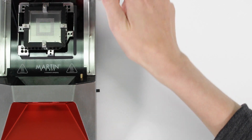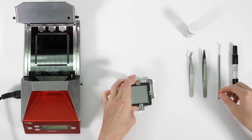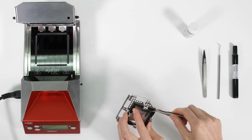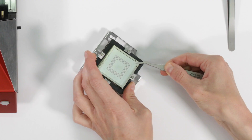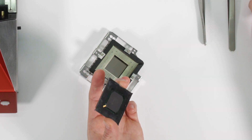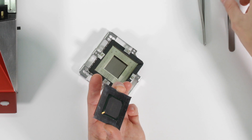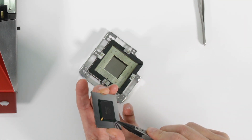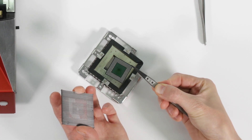After additional cooling time, the fixture can be taken out of the mini oven. Flux residues can lead to components adhering to masks. Carefully remove the component from the mask. It helps to remove it while still warm and to work with flux cleaner if necessary to ease the separation. The SMD hook can be used to help.